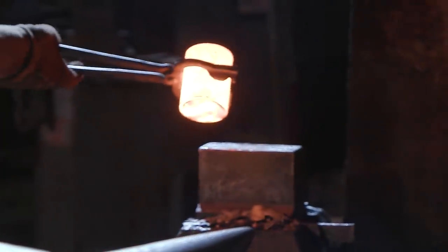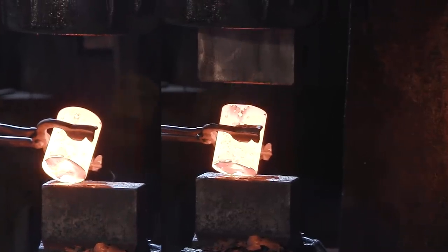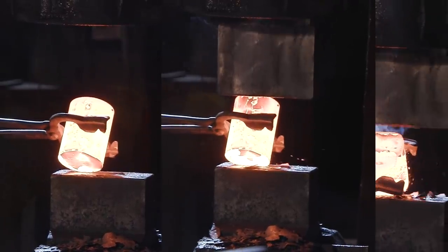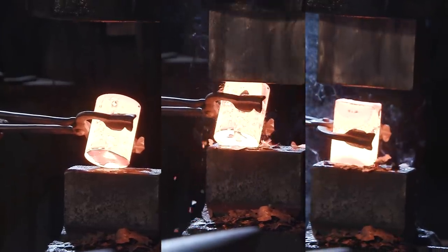I told you we'd figure some way to get some forging in. Since we're building this back spike out of sheet metal — it's over a quarter inch thick — it's just not the kind of thing that will take some damage. So we're going to have Derek take some hot metal, some 10-45 like we used to do some of our larger swords. He's going to first take this big piece of round stock and make it square or rectangle shape, as a preform for him to begin drawing down a point. That point will then replace the point in the sheet metal section, and that will give us something that can take some damage.